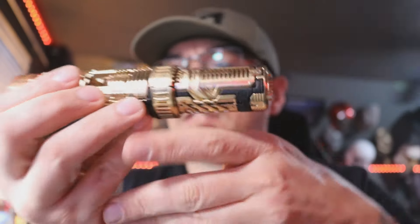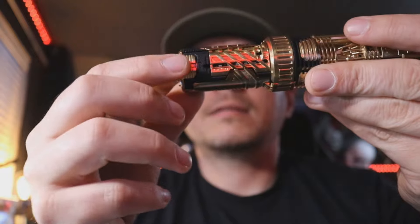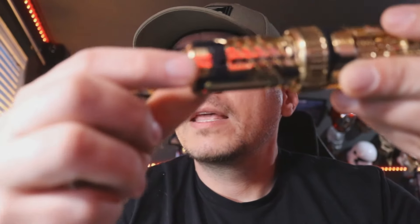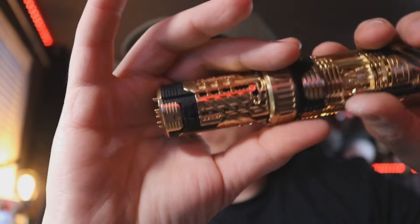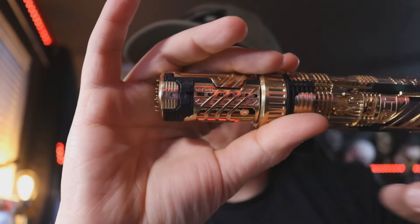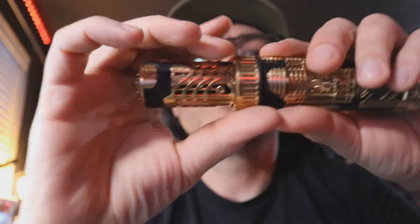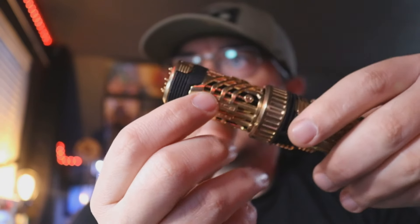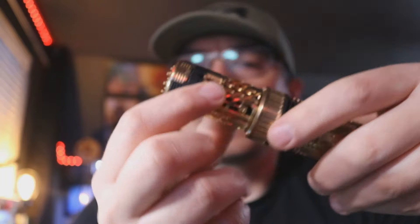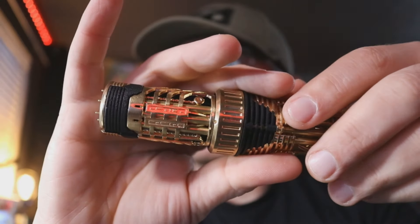When you close it, it stays closed. Each of these chassis have two switches on them so that you can operate them outside of the saber, but I do find that I need a pair of tweezers to get at them. If you look closely right here, you've got a tactile switch right there, and if you go 180 degrees from that, you have another tactile switch right there. You've got your stock rotary PCB with the pins — it's going to be the same on all of them. You've got a 10-pixel accent strip located under here, and another 10-pixel accent strip located under here. This round piece right here has some diffusion underneath it, but it has some shine-through as well, which I'll show you in a second.